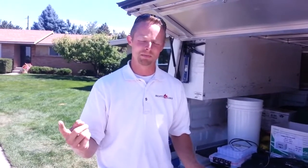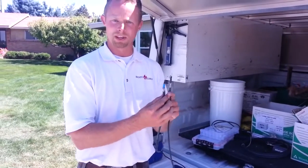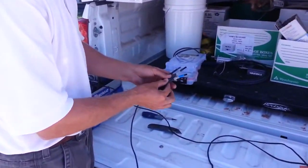Another video. I'm going to talk to you about the difference in the cables that are on the market. There are really only two kinds of cables: a self-regulating heat tape or heat cable, and a constant wattage heat cable. Right here I have stripped down three different cables so you can view them. If you want to come in and take a look at this.